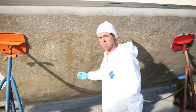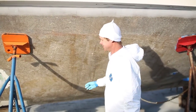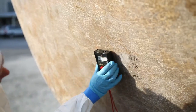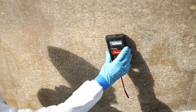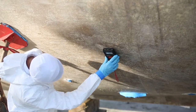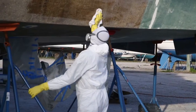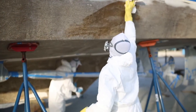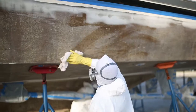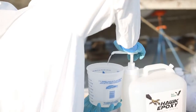Now we're getting ready to coat from the tape line over all our raw fiberglass and seal it with two coats of Hock epoxy to make it more watertight. The hull must be dry — a moisture meter is used to verify that hull moisture is under 15 percent before applying the Hock epoxy. The hull is then wiped down with clean rags and acetone to remove any residue and contaminants left behind from blasting.